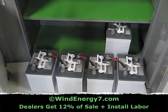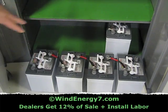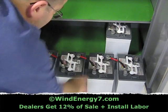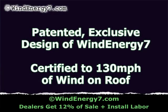Four six-volt batteries. By jumping the negative to the positive like that, you're stringing the voltage together. So that's six, twelve, eighteen, twenty-four volts now. If you check from this post to that post on the two ends, twenty-four volts. We'll see you next time.